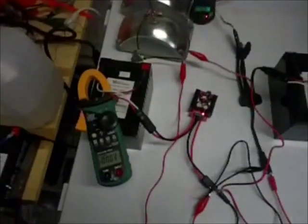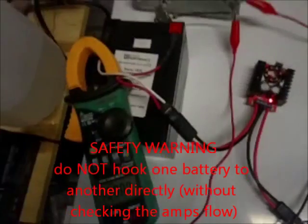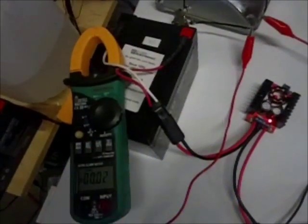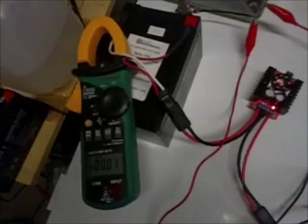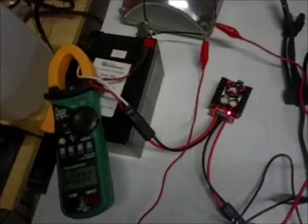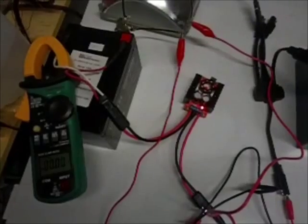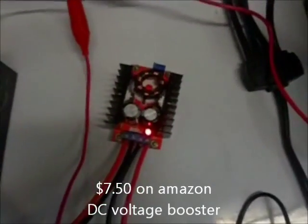Here I have a non-traditional DC to DC type charger setup. I have a good fully-charged battery from the vehicle and a dead battery at 11.5 volts — both are 12 amp-hour universal sealed lead-acid scooter-type batteries. I want to strongly recommend you never directly hook one battery to another, because the high amperage between them — even with these 12 amp-hour batteries — will melt the wires. It's almost like creating a short circuit; you're not really charging, just equalizing. You should only connect batteries with similar voltages to avoid a large voltage difference.